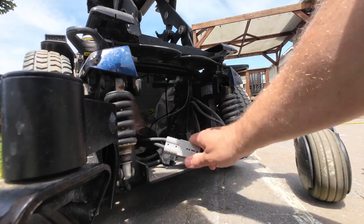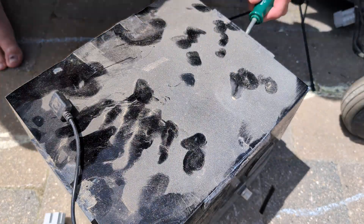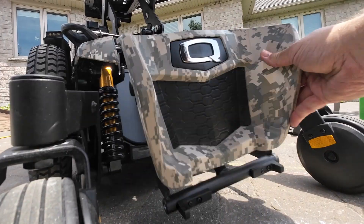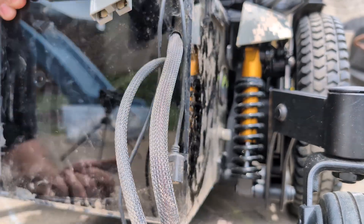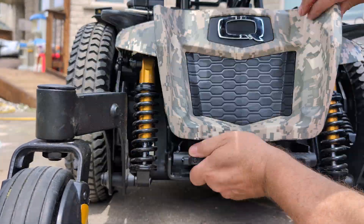Just out of curiosity, when she took delivery of her new chair, she took a trip to town to see how it would do. After an eight and a half kilometer round trip, the new included batteries were down by 50%, and she was super eager to have the LFP battery moved over to her new chair. The transfer was pretty straightforward — I took off the old chair battery cover, disconnected the battery and removed it. I opened it up to check if the weather had had any impact over the past two years, but it looks the same as when I first built it. In her new chair, I disconnected the included batteries, unplugged the original wiring, and plugged in my modified chair connection wire. The space in this new model is just a bit narrower, so the rubber cover on the circuit breaker did pop off while sliding it in. After confirming it was working, I reinstalled the battery cover.